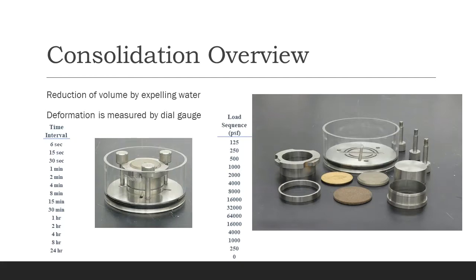In this lab, we'll be using data from a clay specimen, which can be found on the Google Sheets. Our time interval for each stage of consolidation will be one stage a day, and readings will be taken at very short intervals at the beginning of the consolidation stage, and at longer intervals as the stage progresses. We will add more load to the consolidation frame every 24 hours, until we reach an applied load of 64,000 pounds per square foot, at most only doubling the stress.